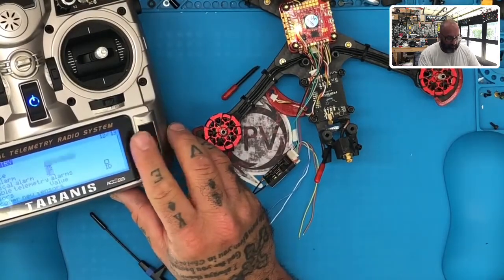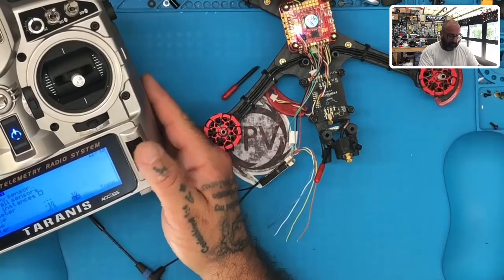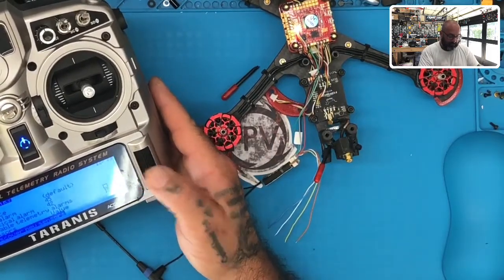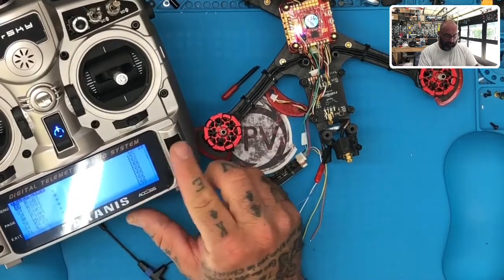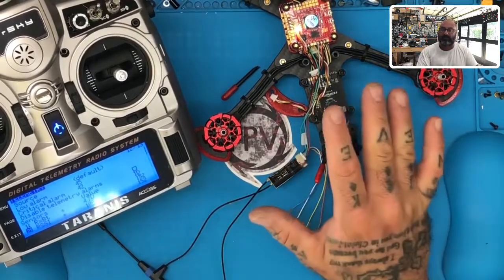And what I want to do is, I'm going to get some simple default values here. But what I want to do is find all my telemetry from the drone, okay? So I'm going to say discover new sensors. And you see that? Automatically populates. And there's all my sensors now populated. That's it. There's nothing to do as far as going into Betaflight and having to change anything on this side, on this F7 board.